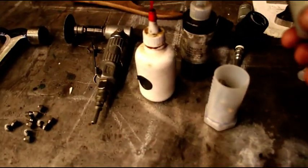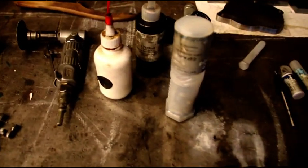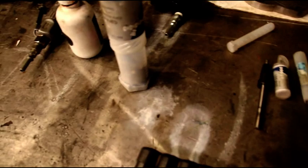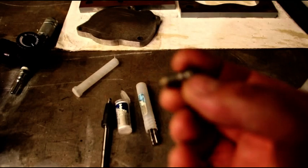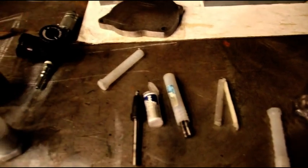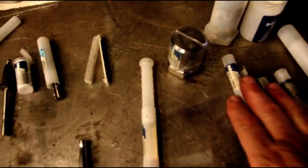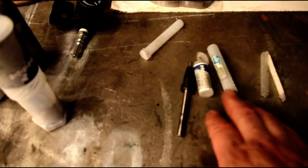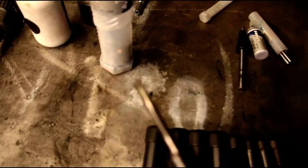And now you can't see it, but those are the CF pins. And I would use those pins for just about everything. The L series, there's one that's a little bit thicker. Bigger diameter, and it's got a thick head on it. They make those in all different sizes. The L series are a little bit cheaper, and you got all your associated countersinks and taps and drills. Here's the countersink that we were using, a couple drills there, special tap. Got to get your tap with the pins.